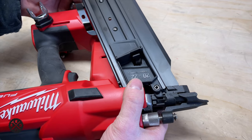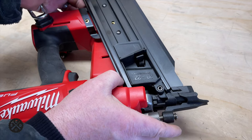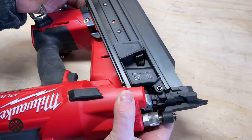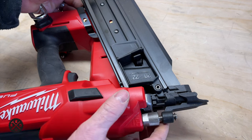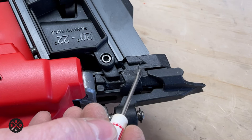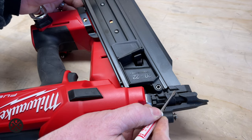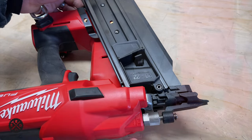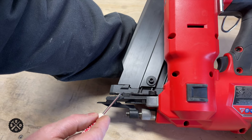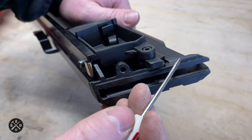Now you can see the difference — see the offset there. So I have my bolts pretty much lined up, but it can fit like that and the bolts don't line up. In order for the bolts to line up, this has to come up. There's about an eighth inch offset right here — see that offset? So in order for the bolts to go through here and line up, this needs to be ground down right here, about an eighth inch. And it's not just on this side — it's also on this side. See that eighth inch difference? So it's an eighth inch offset, and this is a little less than an eighth inch tall.